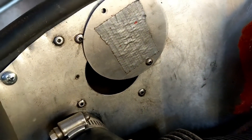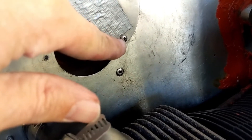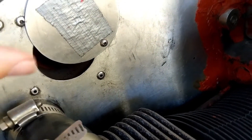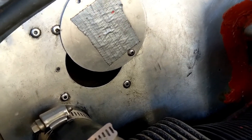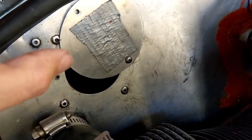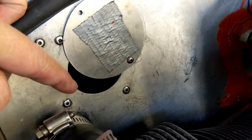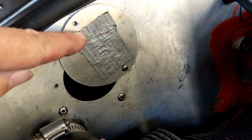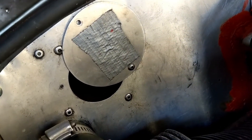This is where the air comes in, and this piece is adjustable just by pivoting it on that screw, so I can open or close it. When I opened it all the way, I got basically zero heat because there was just way too much air going through — it didn't have enough time to pick up any heat. I tried closing it down almost all the way and incrementally on different flights worked on backing it off until it really didn't do much, then pushing it back again, so that's about where I get the best results.